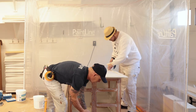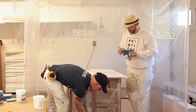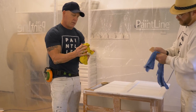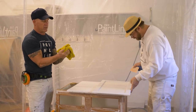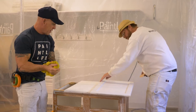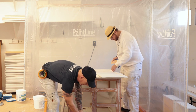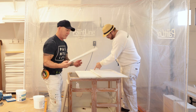I like to keep my hands clean, tools clean — keep wiping them off every couple of doors. Michael's got a rag with him to wipe his tools down. You don't want the aqua coat to dry on your knives, because it will end up causing rough edges on your knife and it won't scrape off smoothly.